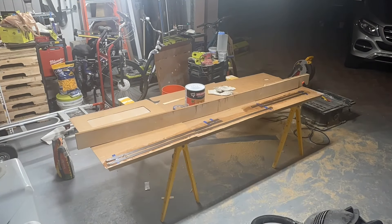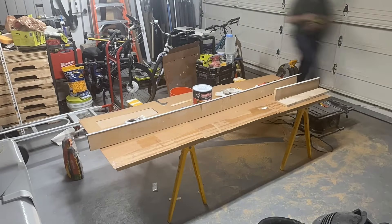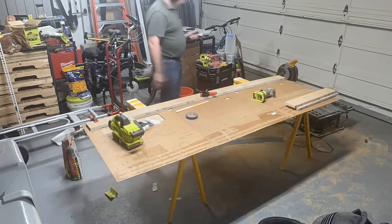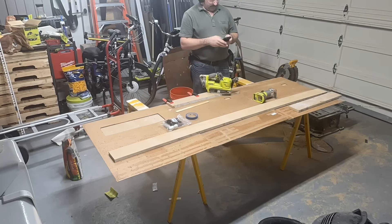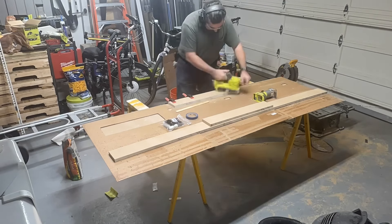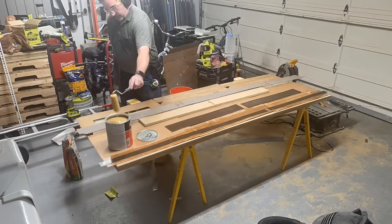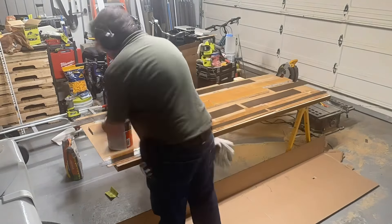So I'm using something you can get from Home Depot or Lowe's, rolling the contact cement on with a really deep nap roller, then sticking and routing as you've seen me do in other videos. If you haven't watched those yet, I do have a how-to series on building laminate countertops with a few more videos still to add.